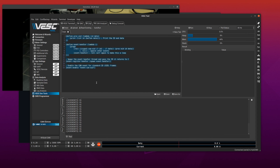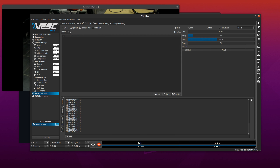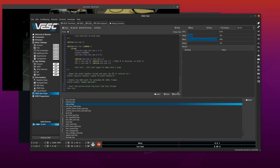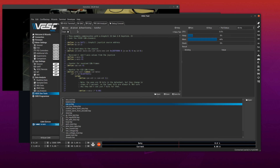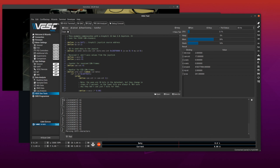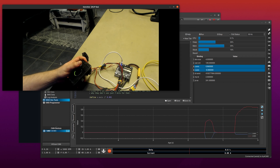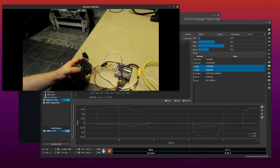This event handler will run by itself and process received events, and you can do other things after initializing it — like having another thread send events simultaneously. For this particular joystick I have a full example that implements the entire protocol. I remove this code, go to examples, open the CAN joystick example — it's only about 100 lines of Lisp including all comments. After uploading it you can see a bunch of data showing up; select the X and Y axes, go to the plot, and moving the joystick shows red for Y-axis and blue for X-axis.